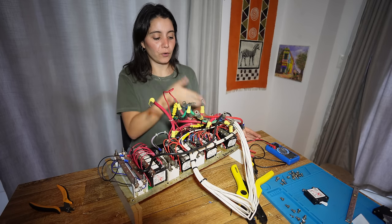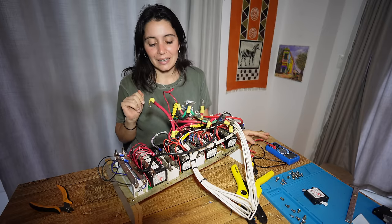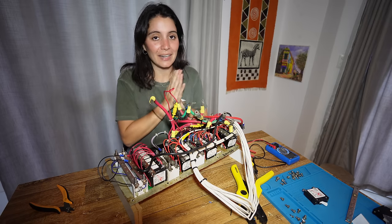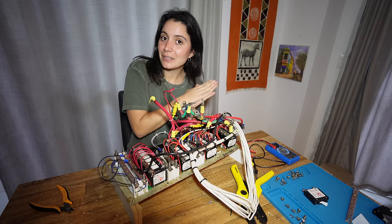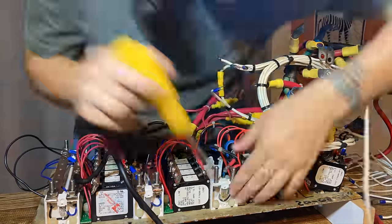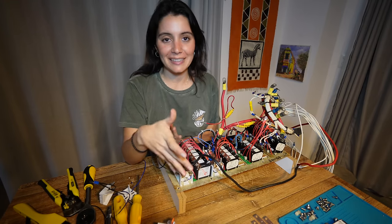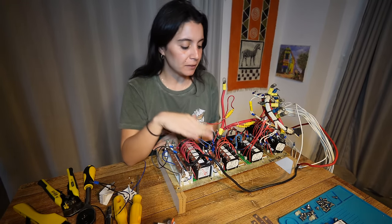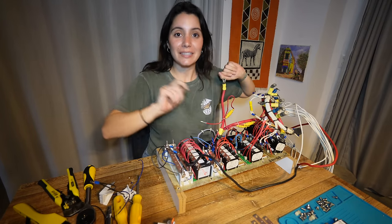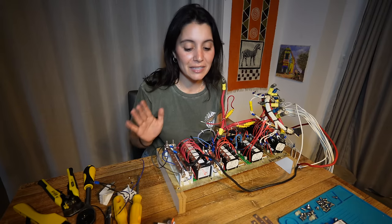The first set of lights is done. We have another three — one the same size and two smaller ones. I'm going to do them now; I think it's going to be a lot easier because I already broke the ice. After everything is replaced and all the lights are 24 volts, I'm going to connect all these disconnected wires. I hope everything goes well and then we're going to test it. All the dots were eliminated and it went a lot faster and easier. Just one more to go, and then we're going to bring the panel back to the boat and start installing everything — turn the switch on for the lights, the pump, and whatever else we want to add. This is a very big milestone.